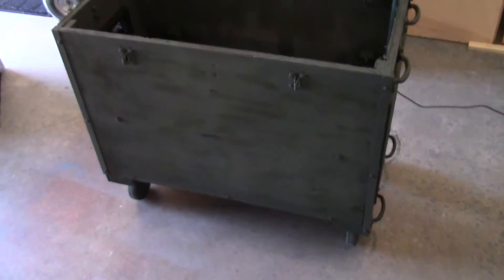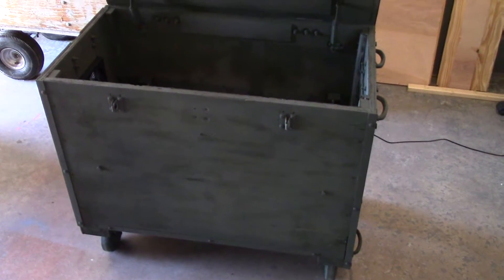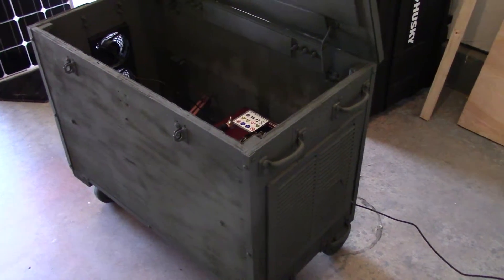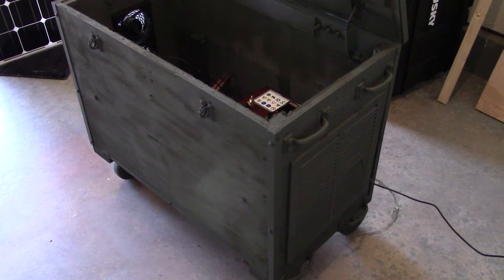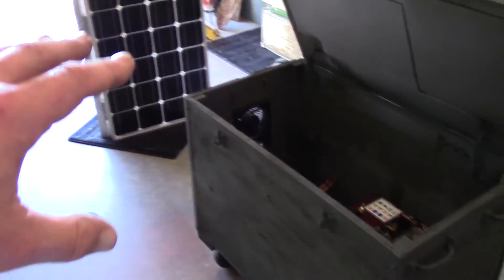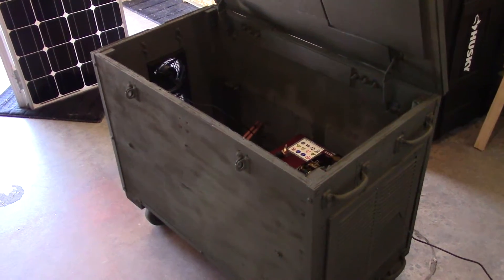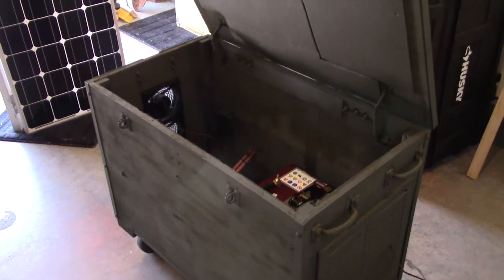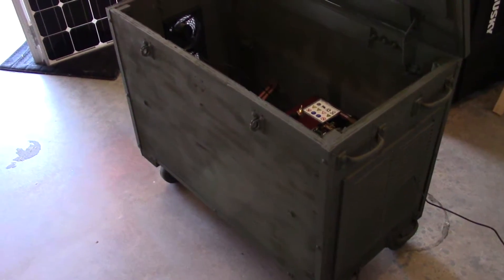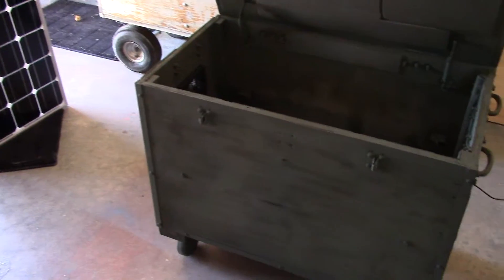Designed to safely run, I'm anticipating about two kilowatt-hours overnight, which is plenty of power to run a full-size fridge and a nightlight — whatever you need. It's not meant to run a 2,000-watt compressor or a full-size air conditioner; maybe a small window unit, but that's about it. The whole idea is to be a self-sustaining 24/7 operation if needed. With 200 watts of panels and the Tracer controller, it'll handle 600 to 800 watts at 30 amps pushing back into the batteries at 24 volts.